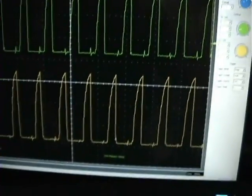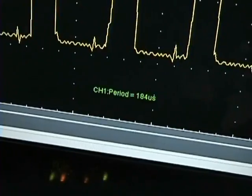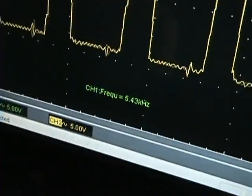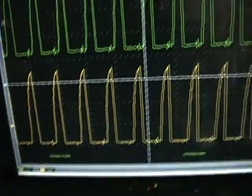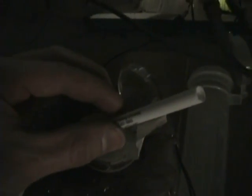I'm getting this to max speed — I have to hold it, it's going to be hard to film. There you go. I'm actually faster than I thought — that's 184 microseconds peak to peak, and my frequency is 5.21 kilohertz. You can see every other pulse running on the scope.